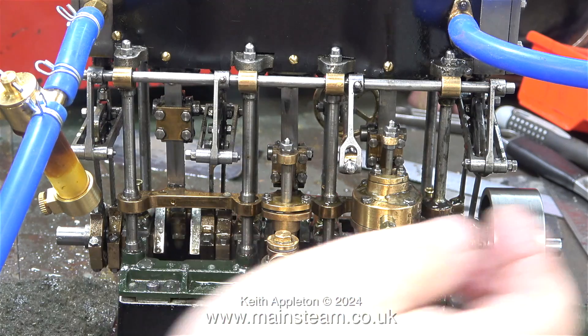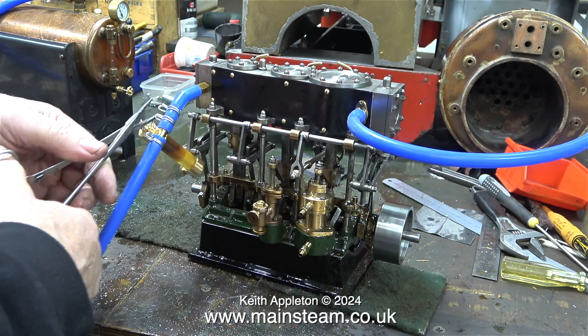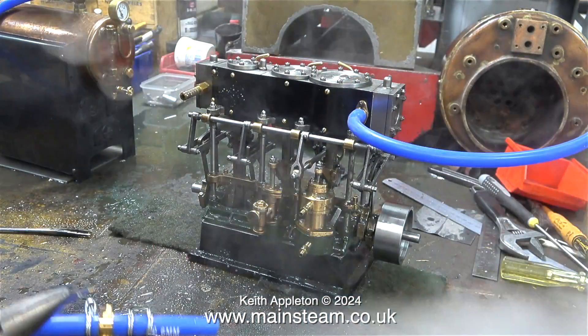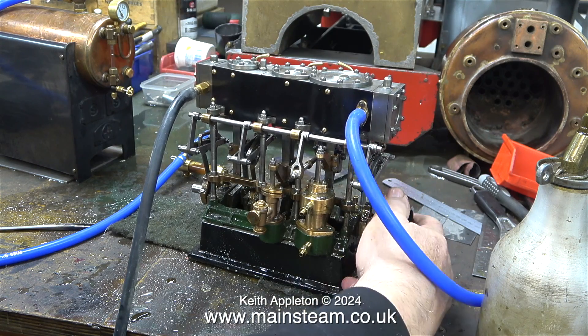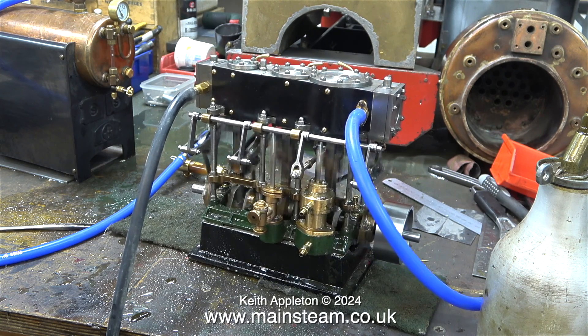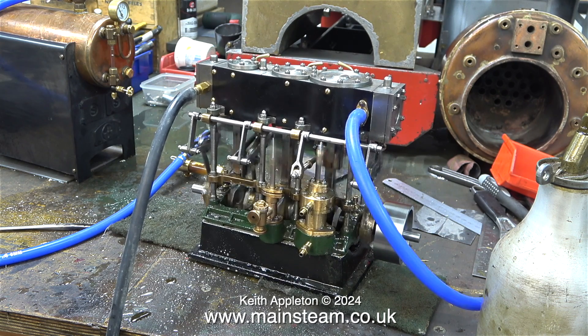This engine runs so much better using steam. I removed the burner from the boiler a while ago. Now it's time to remove the pipe using a sharp blade and then replace it with a compressed air pipe. Note to self: turn the steam tap off before you take the pipe off. There's only about 15 pounds per square inch showing on the gauge, but it's worth remembering that this steam is still very hot. I've connected a compressed air pipe and once again I'm rotating the engine to blow all of the water away from the cylinders. As you can clearly hear, the engine still does run well on compressed air, but it is not the same.